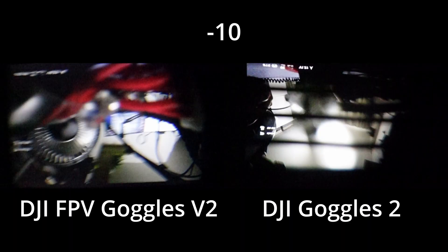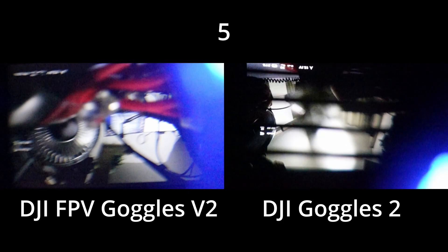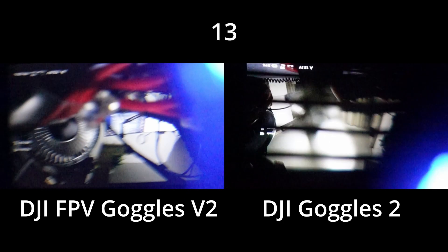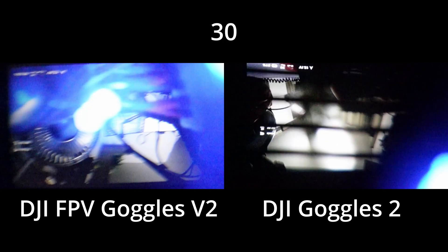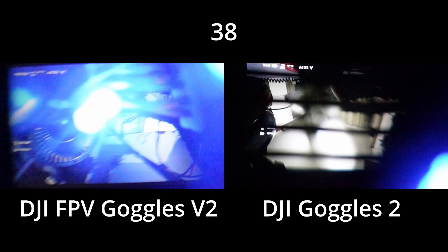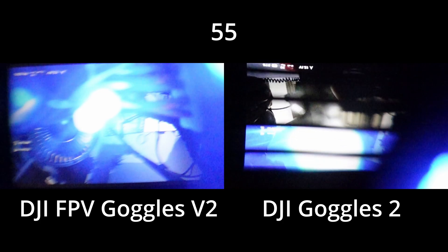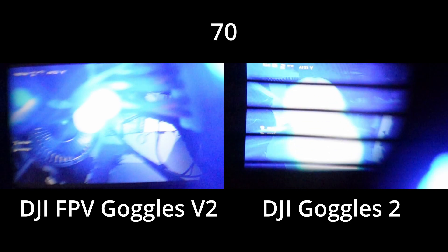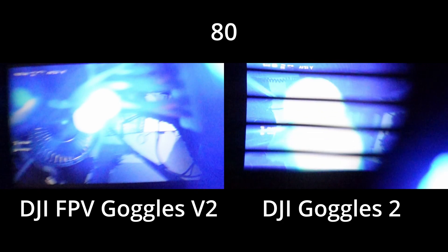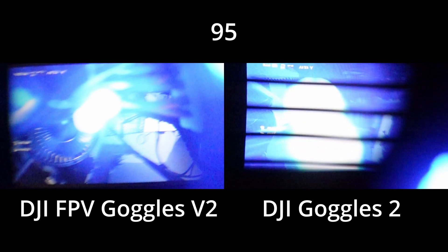Now that we know how the measurement is done, let's take a look at the test data. Here we see the high-speed footage from the two goggles side by side. At time zero both LEDs turn on, and we see the light from the LED directly in front of the high-speed camera immediately. Then we have to wait a few milliseconds for the FPV system to transmit the bright LED to the goggle screen. That time delay between the LED turning on and us seeing it on the goggle screen is the latency of the video link. This footage also shows really clearly the difference between OLED and LCD — I'll put a link in the video description if you want to learn more about that.